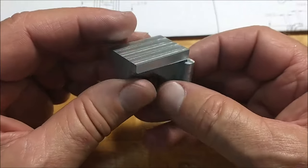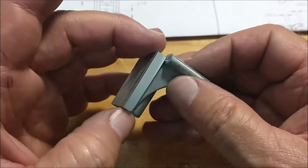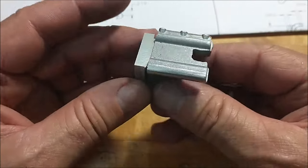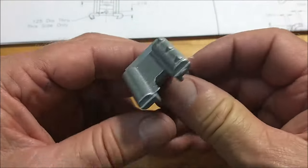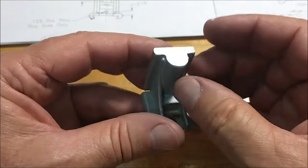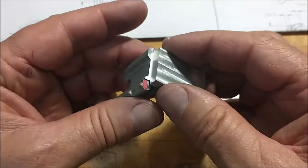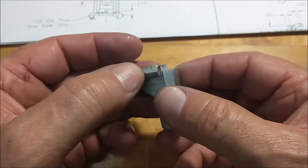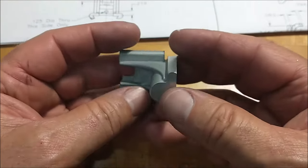After some preliminary milling, this is what we got. Now this is just a chucking block right here. Nothing is to dimension. This just allows me to have a parallel on any of these surfaces. Pressure, stand it this way, push it against the jaws this way, take heavy cuts, whatever. It's good to have surfaces you can trust.